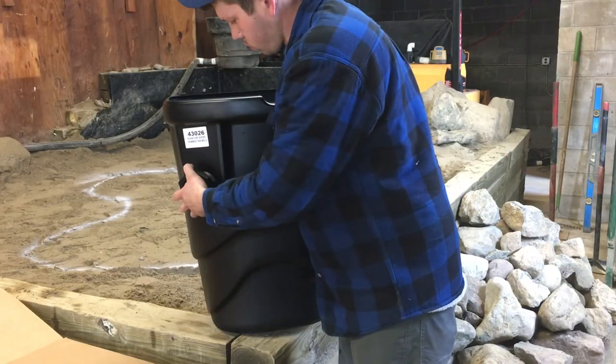How would you install a skimmer onto an existing or new pond? First of all, it only works if you've got a rubber liner pond. If you have a tub pond or a concrete pond, putting a skimmer on is really not feasible. If you have a rubber pond and the liner has started to get brittle and hard, it's also not feasible because you need a good connection with the existing liner — cutting a hole in an old pond is not something we get involved in. But if you've got a fairly new pond, maybe four, five, or six years old, or a new installation, let me show you exactly how we put a skimmer in. We're working with a Signature 1000 skimmer here.